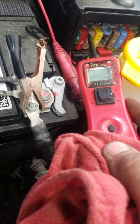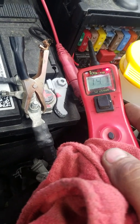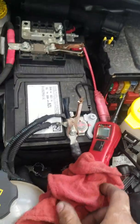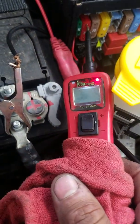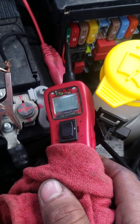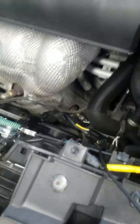Let's go ahead and connect this fan - it would have blown by now if the wiring was the issue. As soon as I plugged in the fan, it blew my homemade fuse. No power now, but we had power before. So pretty much it's the fan - it's messed up. It's going to be a straightforward fix.